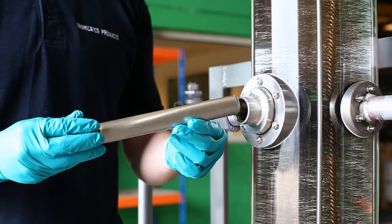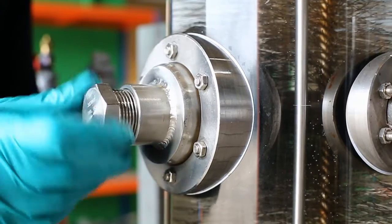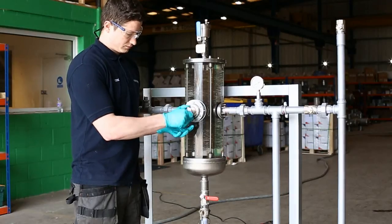The high-gauss magnetic rod is inserted into the unit. This magnetic rod attracts all magnetite within the water system and is guaranteed to remove all traces. The stainless steel strainer, which can be seen inside the unit, is designed to remove air, micro-bubbles and dirt down to 5 micron and less.